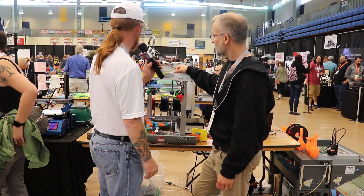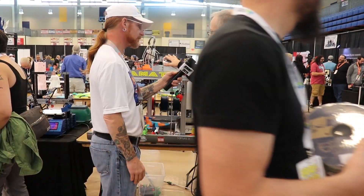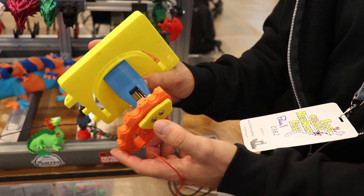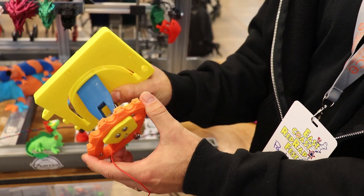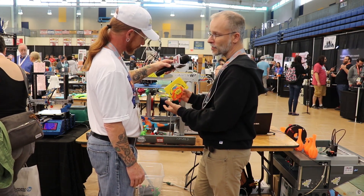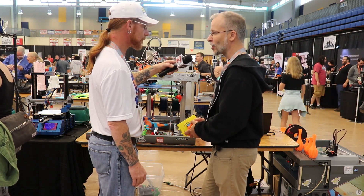So tell me how many heads you got and how it works. It's got five independent hot ends — those are the five heads. Basically what you have is just a hobby servo up on top which turns the heads to different positions. It uses a detent system and you rotate around, so the hobby servo just has to get it close to the position it needs to be to lock that head into place. It's a fairly robust system with some limitations, but it works relatively nicely for the type of prints I'm trying to do.